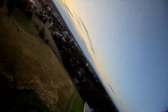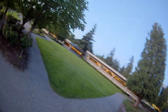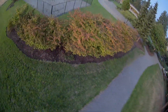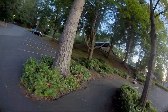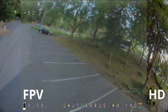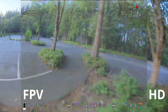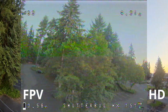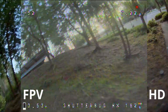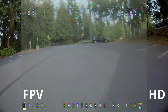Unfortunately there are downsides to using a split-type HD camera, and that's pretty typical. The FPV experience is generally not going to be as good as a dedicated FPV camera, because the signal runs through a complicated HD sensor and DVR board before it gets to your goggles — that adds latency. Also, the FPV view is the cropped middle part of the HD video, so you lose the wider image. When flying micros, having a wide field of view is really important for spatial awareness and flying proximity around objects.